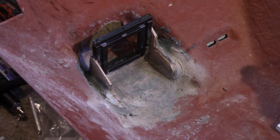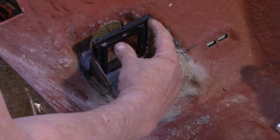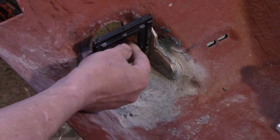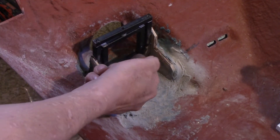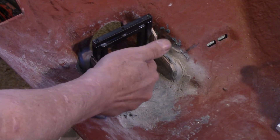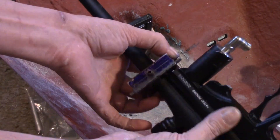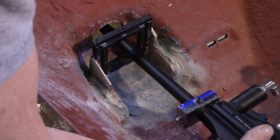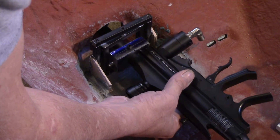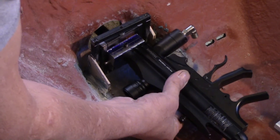The last thing I have to do is pull these two bolts, pop the top bar off, pull the frame out, take that apart, and take these two bars — see how smooth that travels — take those two bars in and put a 7/32" hole in them to match the posts on the trunnion. Then the whole thing will go in. I've got it marked for height.